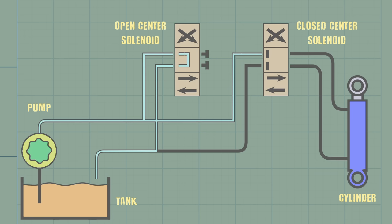If I go forward, should get both yellow lights. If I go to one side, one should get dim, that's the steering. And the opposite in reverse. It actually works. It seems so simple, but it has taken literal weeks to get to this point. I've got to tune the system for the actual solenoids, but we should be ready to try this, finally.